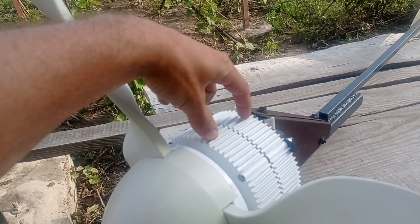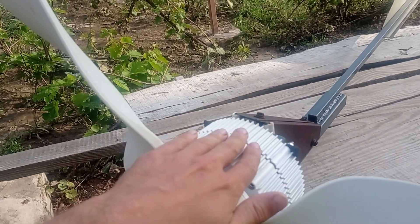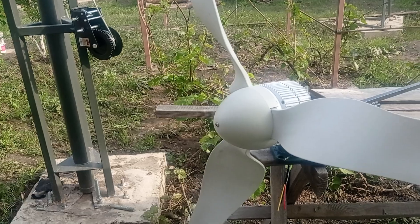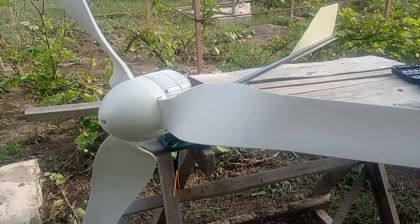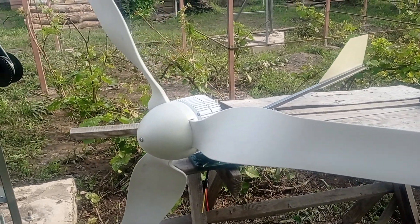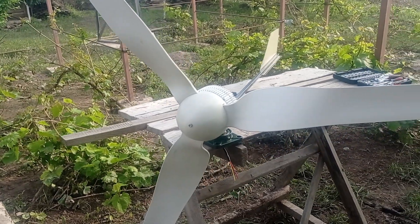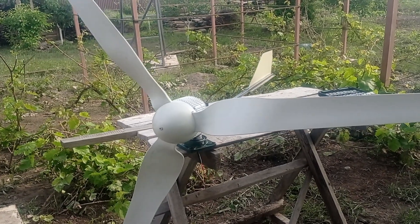For $200, what you get inside is 26 millimeters of steel for the stator and 26 millimeters for the rotor thickness, with magnets 3 millimeters thick. I've been opening it — check my other videos if you're curious. I rate this generator at 500 watts. It may peak at even one kilowatt or more during stormy times, but in general you'll likely see it running at around 3 meters per second producing maybe 15–20 watts — wind speed rises and so does production.